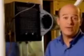Once a year, usually before the heating season, you should check the water line. That's this feed tube right up here. It's also this strainer, which goes right in here, this opening or orifice, which is right over here, and this drain line, which is right here. The strainer and drain hose need to be flushed and cleared of any blockages. If there's any sign of residue in the drain line, you should call your contractor for service. Inspect the water feed tube by gently flexing it and looking for signs of cracks or signs of wear. Replace the tube if it's cracked, brittle, or damaged. Consult your owner's manual for step-by-step instructions or call your installing contractor for help.